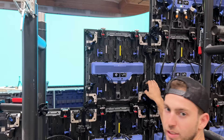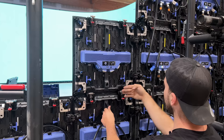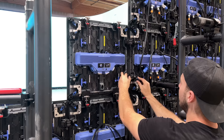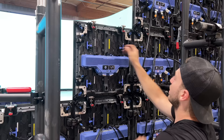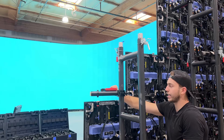Once the panel is in, we lock it in four sections — two at the bottom and two on the sides. We're doing a zero-degree curve, which means flat. Set it to zero, make sure it lines up, then lock it down — that's secure, it's not going anywhere. I'll do the same with the top one. Lock it in at zero, bring it in, lock it down. Then we put the bracket on the back to attach it to the trussing.